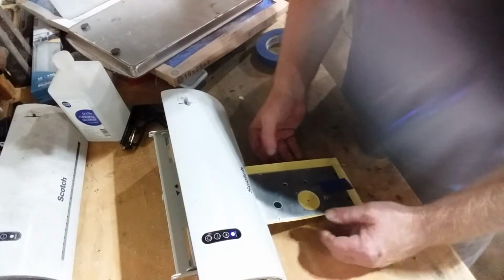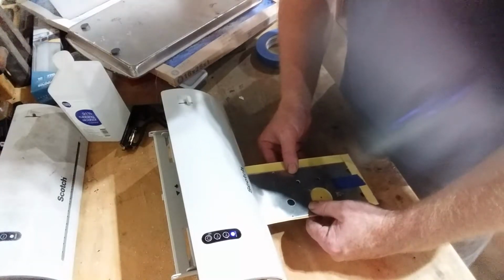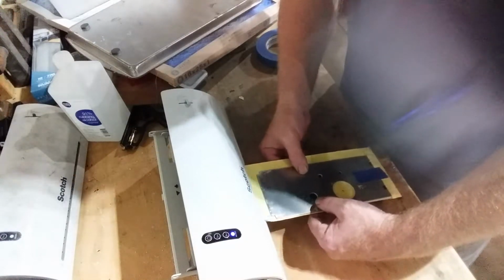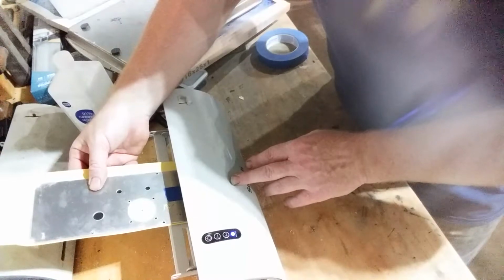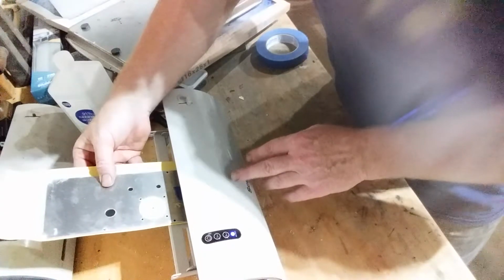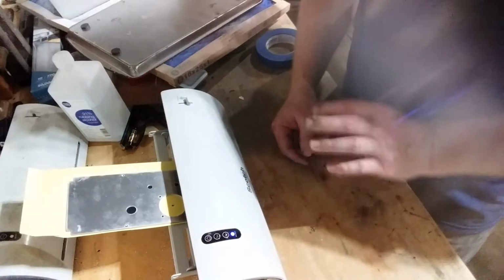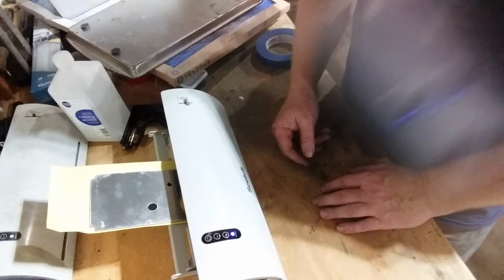The other thing you can use is if you have shipping labels, like full sheet or half sheet shipping labels. The backing paper from those, if you actually print on the waxy side, like where you peeled the shipping label off, you got to take the shipping labels off. But if you use that backing paper and print onto that waxy side, that works really good for toner transfer.